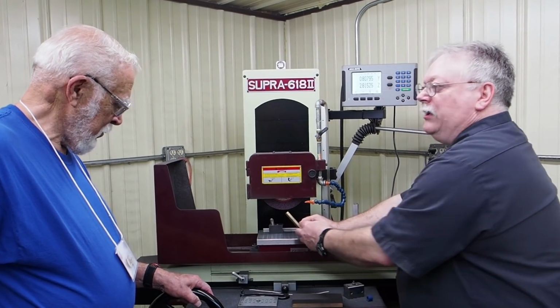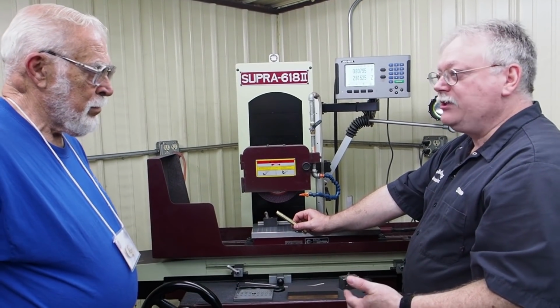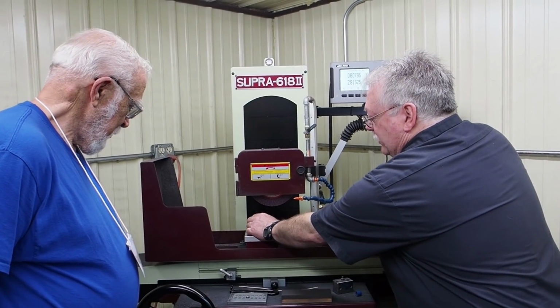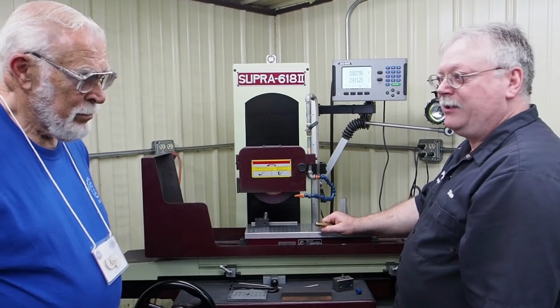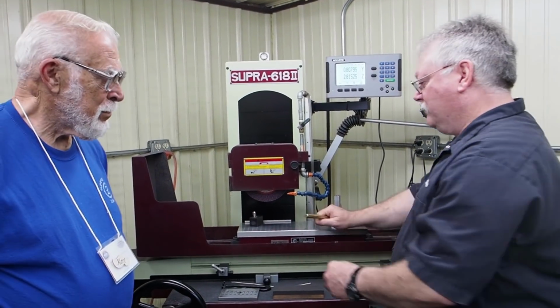You rotate it again, and so you can keep rotating it. With the single point diamond, you can use that for years, and it'll cut good. But once you use that diamond this way a few times and you get a flat on the end, you might as well throw that diamond away. Either that or use it for roughing your wheel out by hand.